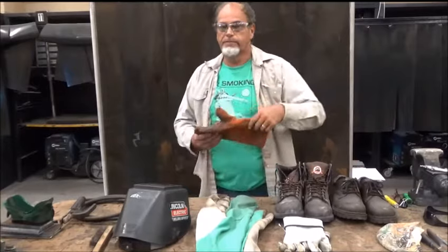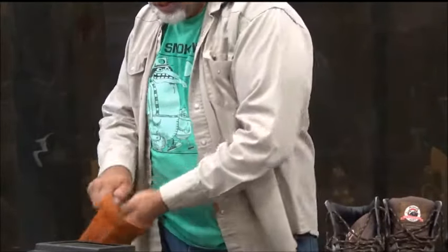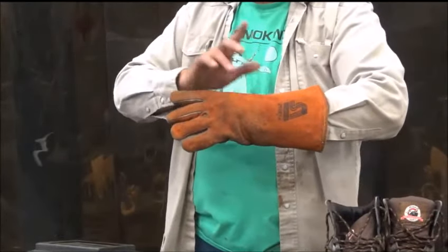Let's talk about the glove. You're going to want to use a welding gauntlet glove — a good heavy glove. Look at it, make sure it's not torn in here or between the fingers. When you put this glove on, it should protect your hand from sparks coming across the back, because as you're welding there's going to be a lot of sparks, so keep that in mind.